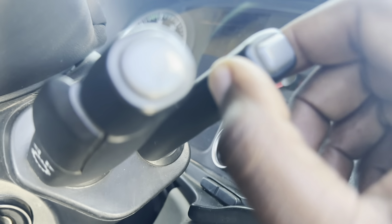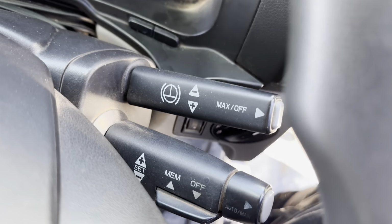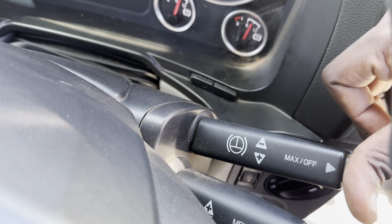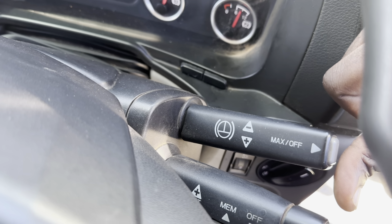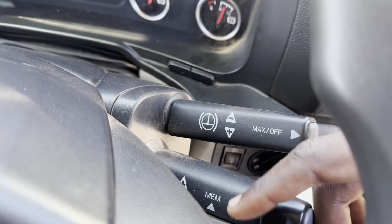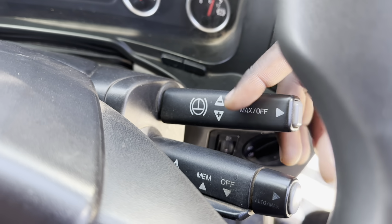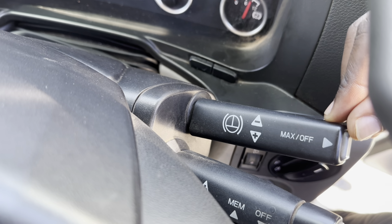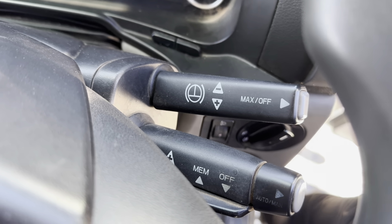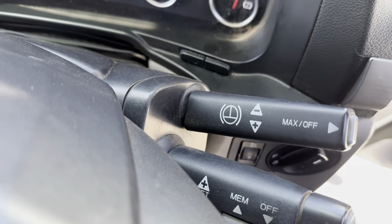So this one is your retarder. Let me show you like this. I don't know if you can see it. Yeah, exactly. This one is your retarder. When you press this button, remember, it's a harsh brake. You don't have to press it while you're on automatic and when you are loaded. But if you are on manual, when you press it, it's just going to make a combination of a brake and a retarder at the same time, stage 5 and a brake, harsh brake at the same time. But it won't react so badly. Ne? But don't do it.